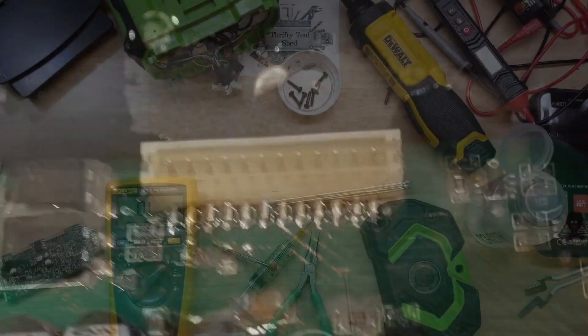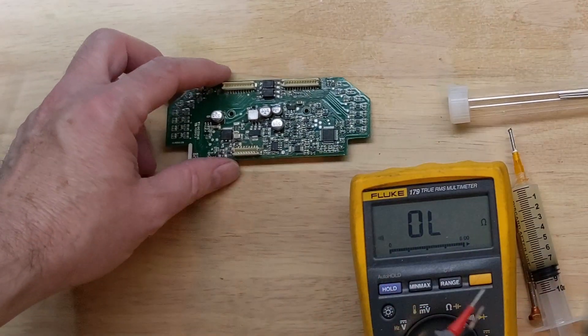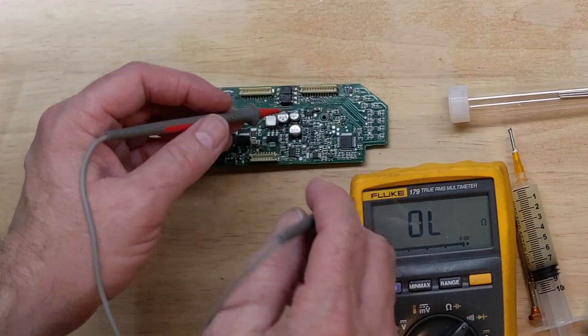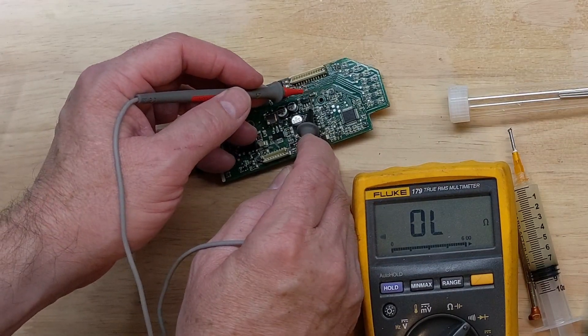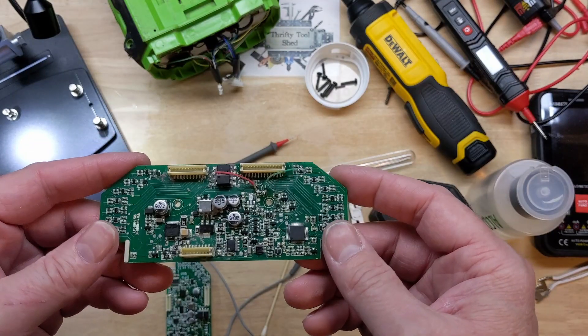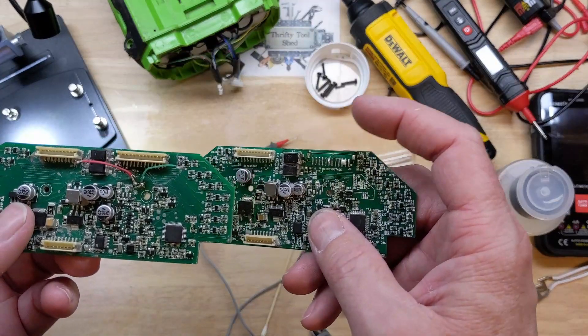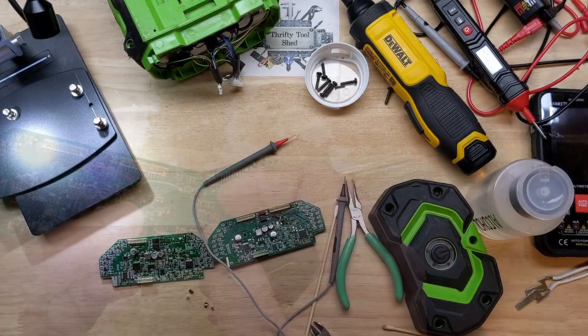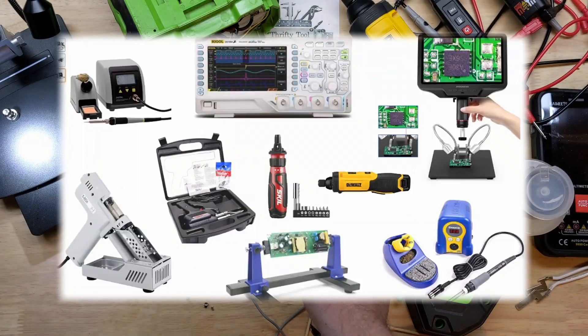At this point in the video I started troubleshooting this board again after replacing the connector. We go through and see shorts on the board, then injected voltage and found out that the microcontroller itself was faulty. If you want to see more of that troubleshooting, there's a link to that video at the end of this one. I'll have a link in the video description for many of the tools used today, including the jeweler screwdriver set, the low melt solder, the irons, and even the microscope. If you found this video helpful, please like, share, and subscribe. Thanks for watching and God bless.